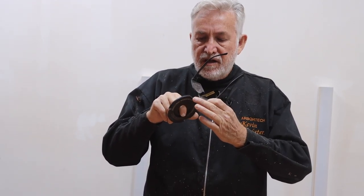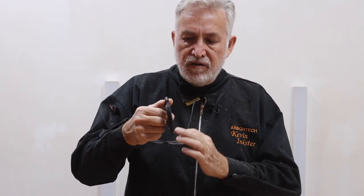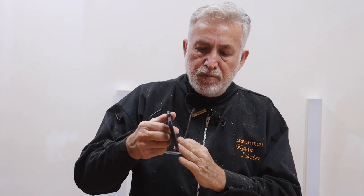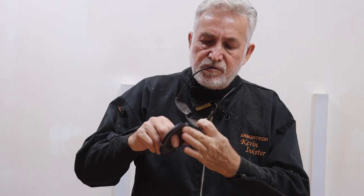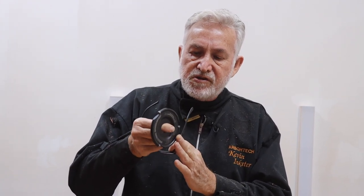I want to give you a few tips about the industrial woodcarver. This is a real favorite of mine — it's the blade I would choose to use if I was doing really tough work, especially burls and things like that. It's got replaceable carbide teeth that you can rotate. It cuts on its head, and unlike the turbo plane and turbo products, it actually cuts on the periphery as well as on the side, but they're very small little round carbide cutters.